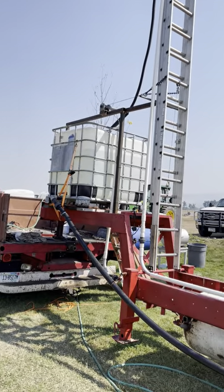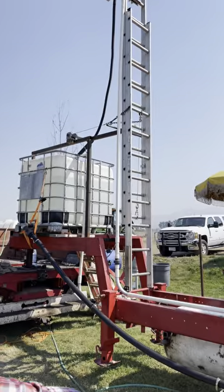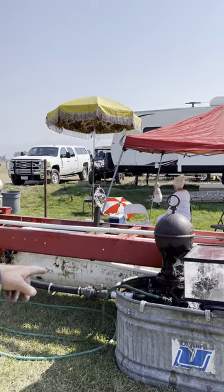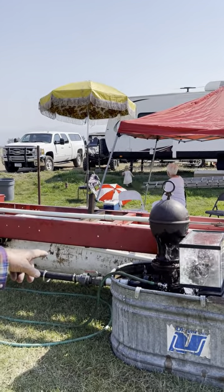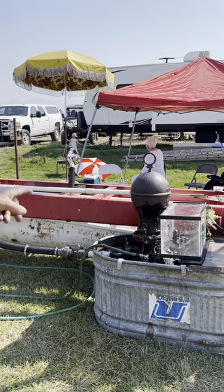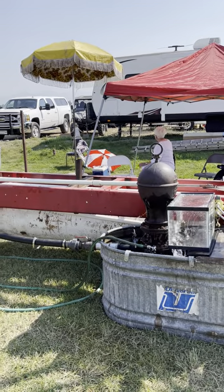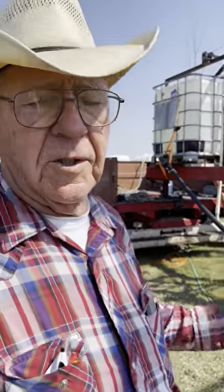That's the dam, that's the tank. You run a pipe out from the bottom of the dam going down toward the stream, and the water runs through this hydraulic ram. The principle of the thing is: the water is rushing down and you suddenly stop it.